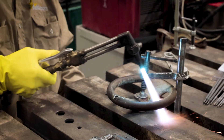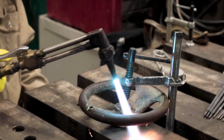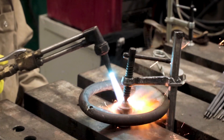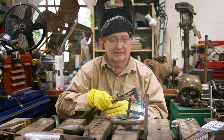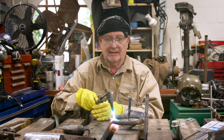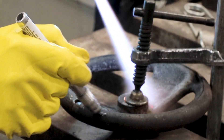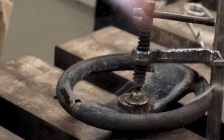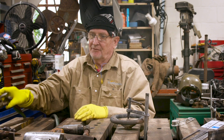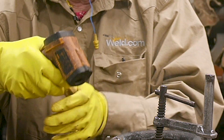We fire it up and away we go. You want to heat this real evenly — we're not trying to melt it, only trying to get it up to 350°F. My oxy-acetylene flame is about 6,500 degrees; a propane burns-o-matic is nowhere near that hot. I spent five minutes with the propane torch on it earlier and it didn't get anywhere near hot enough. The infrared now reads 441°F — just like the highway that runs right by the shop. We're ready to put some metal on it.